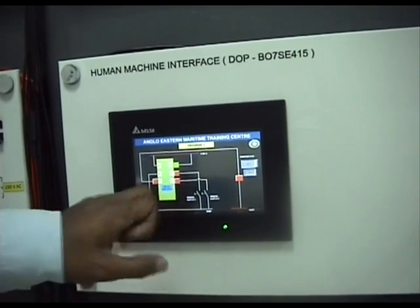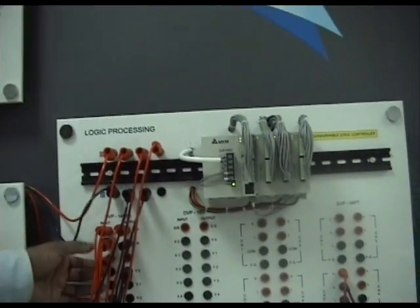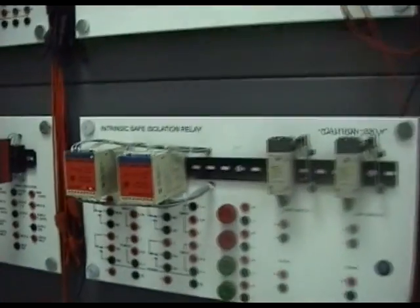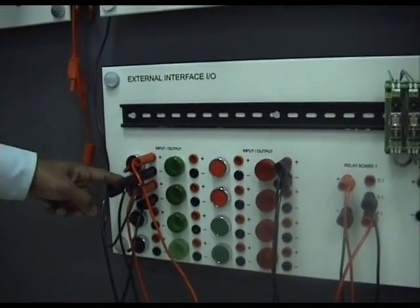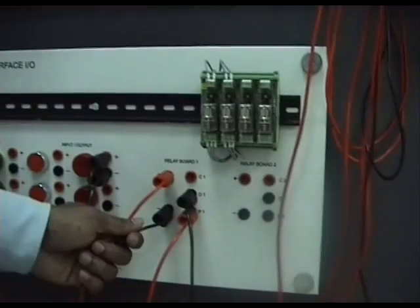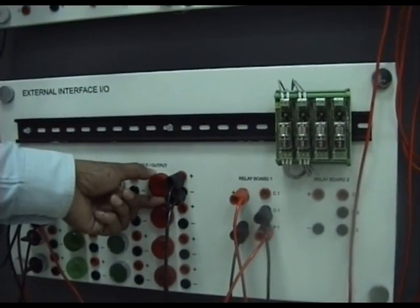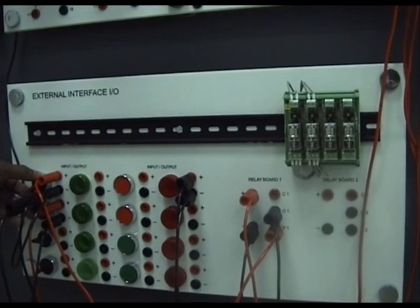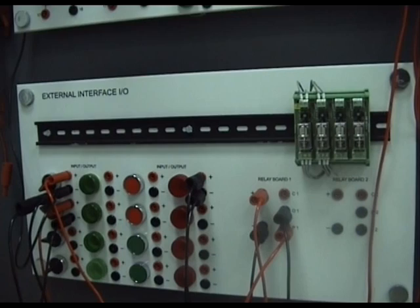You can see X0 and X1 terminals come on. We have now made the necessary connections from the PLC. X0 and X1 terminals are connected to these switches here — this is X0, this is X1. We have also connected the output to the relay. The relay output normally open contact drives this lamp. If our logic and connections are correct, once we manipulate both inputs, at the end of 40 count time, or 4 seconds, this light should come on.